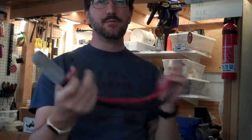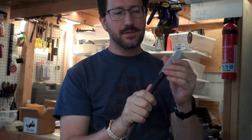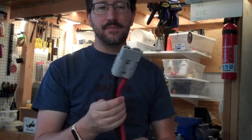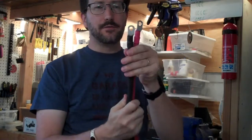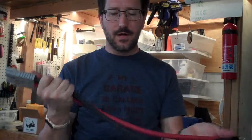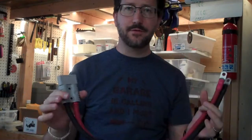You can just buy these cables. This is an SB175 gray — it's an Anderson connector, SB175, up to 175 amps and 600 volts, although we're just using 24. This is a 1/0 welding cable, and these are 3/8 terminals. This is what I'm going to use to connect to the inverter. I bought this cable off eBay — you just specify what type of connectors you want at each end and how long you want it, and they'll sell it to you. This cost me about 30 bucks.